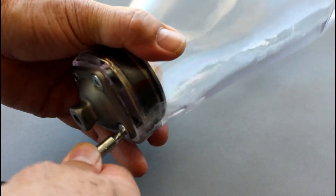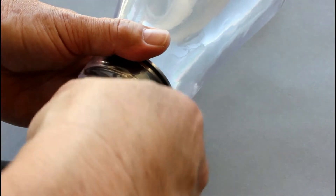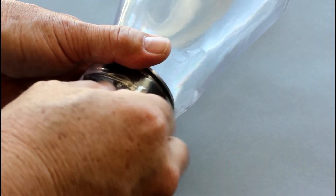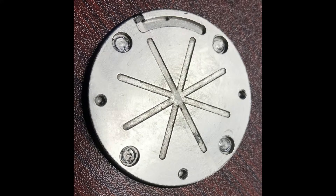Snugging the four-hole adapter down onto the socket, I can double-check how the long screw relates by turning it in and out, trying to feel whether it's tightening or bottoming out — it's really hard to distinguish. I'll remove it and replace it with the medium screw that comes with the lock, so I know it's safe to torque down. Here's a picture of what happens when a screw bottoms out — you can see galling at the bottom where the lock has been damaged.